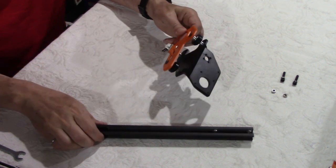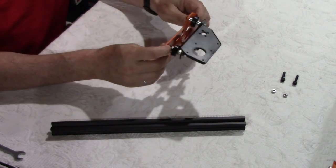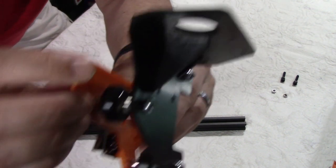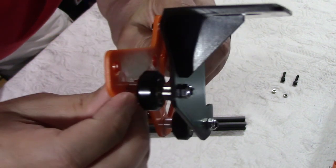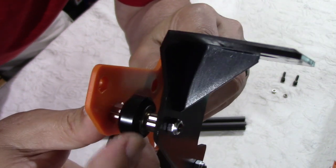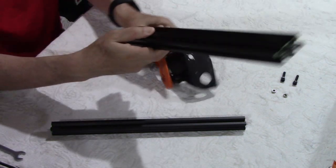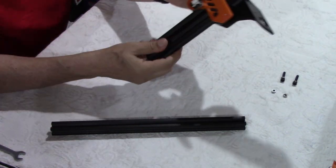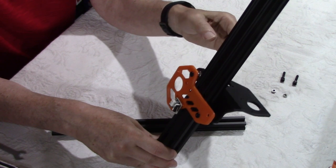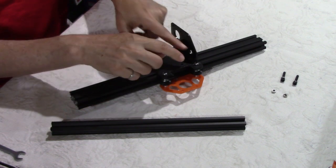Before installing this bracket on the x-axis rail, I think it makes sense to install the wheels first because it will be difficult to align both rails at the same time. The eccentric nuts have a notch — this is how you know they are oriented exactly the same way, otherwise the wheel will be at an angle. With the current setting, it goes perfectly, and if you put it at an angle it slides down slowly with no wobbling. This is perfect — I'll tighten the three bolts at the back.